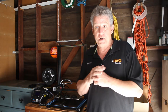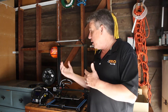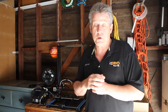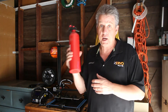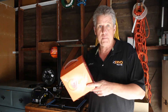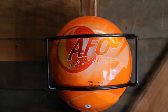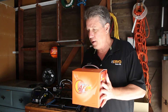I do want to go over a little bit of the safety aspects. There have been some instances where 3D printers have caught on fire — they're running for a long time, they're hot, and you have electronics running. So take safety into consideration. I have a smoke detector mounted right above the printer. I've got several fire extinguishers both on the bench and on the far side of the garage. And I have one of the AFO fire extinguisher balls mounted above the printer — if there is a fire, they have an internal fuse that lights, it explodes, and puts out the fire. That gives me peace of mind and helps me sleep at night. I got mine on Amazon for under $50.